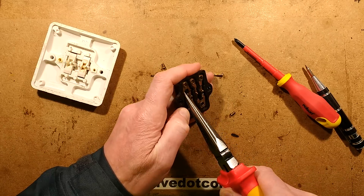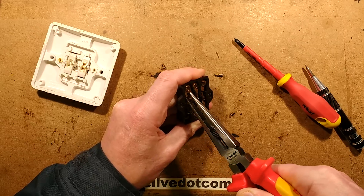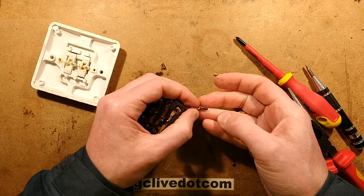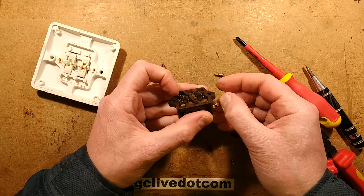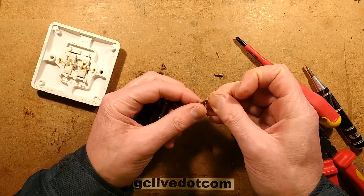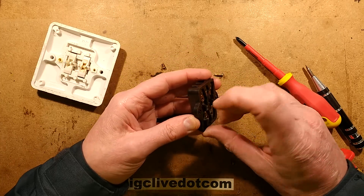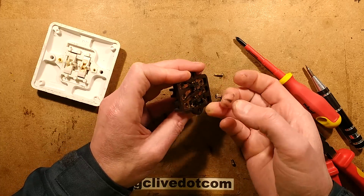The contacts are looking distinctly corroded and grubby. I think it is just aged though. That particular light I very rarely turn on — it's at the other end of this room, where I used to do a lot of filming on the old round wooden table, but not any longer. The contacts really are just pitted and burnt. I'm not sure why though — is it pitted or just corrosion? Because I don't think they've really seen much of a load. Yeah, they're just wiping off and they're clean, so I think that is just oxidation.